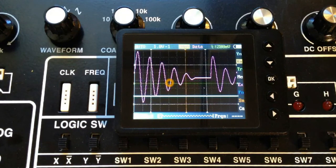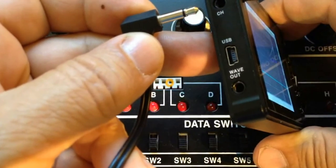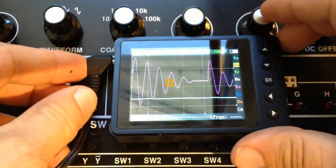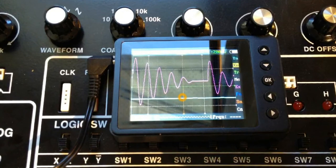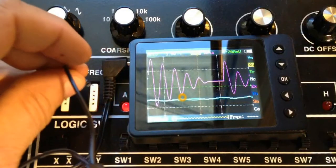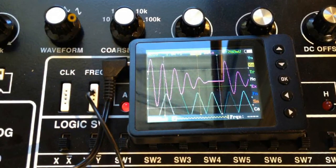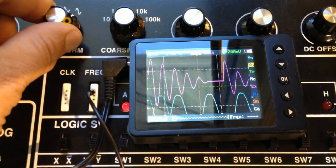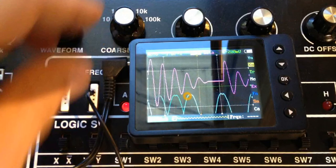Let's hook it up to a simple signal and see if we can make some adjustments for a sensible display. I'm going to plug in the probe connection at the top. You can see a little bit of rippling going on because we're getting some noise. If I touch my finger to this I get even more noise. Now let's plug one side into ground and the other into the frequency output. You can see a non-triggered waveform showing up. My function generator — this Elenco trainer — is set to triangle wave; I'll set it to a sine wave, and now we have a sine wave.